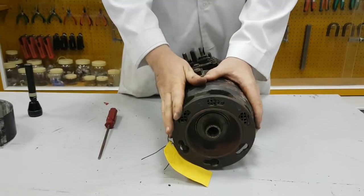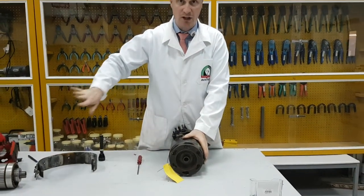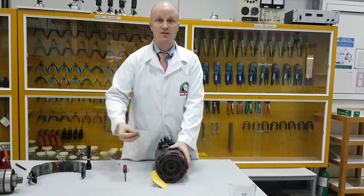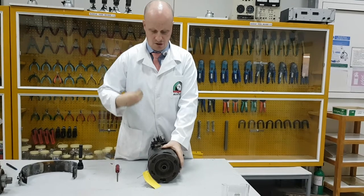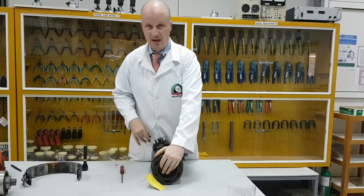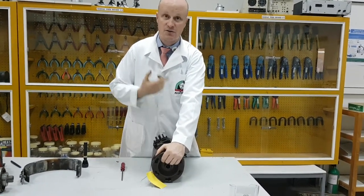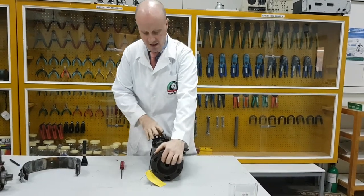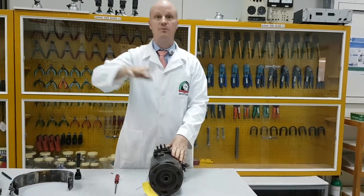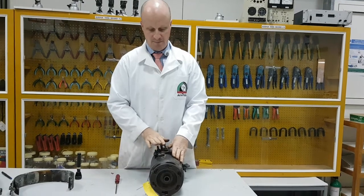Once the engine reaches a certain speed, a certain RPM, the external circuitry that we're going to look at in other YouTube videos is going to kick in. Our igniters and all those things are going to operate. We're going to put fuel in the engine. And after a certain speed, all of that circuitry will disconnect. The engine will then be rotating at a certain speed, and that will induce a voltage. And then the output voltage, after it reaches a certain voltage, from the output of our generator, will connect on to the aircraft electrical system and provide power.